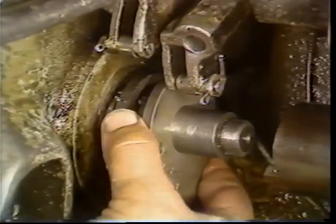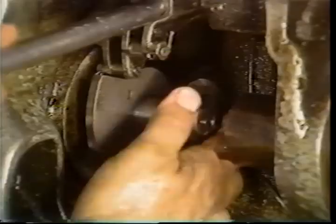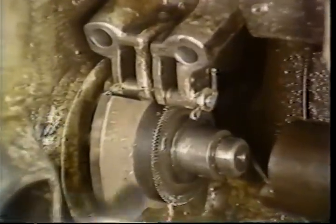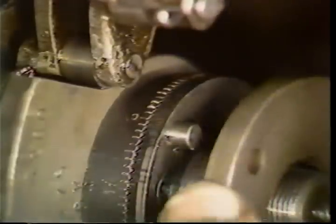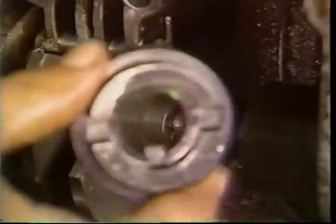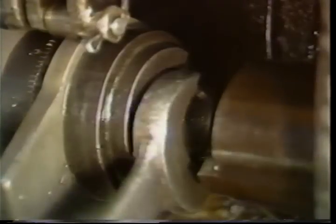Before replacing cams, be sure all dirt, chips, and sludge are removed. The adjustable cam holders used have a zero point marked on both halves — be sure to align the zeros when replacing the holder. This ensures the locating pin is at the proper location. The spacer has a key which must be aligned with the keyway on the shaft when replacing it. Once the locking nut is secure, slide the collar back into place and tighten the set screw.